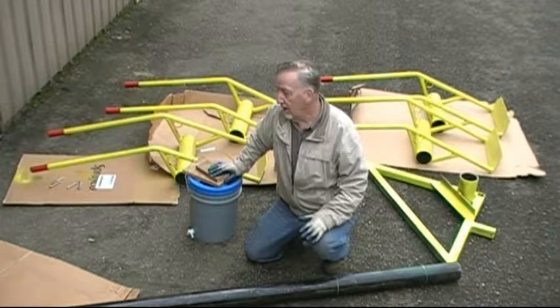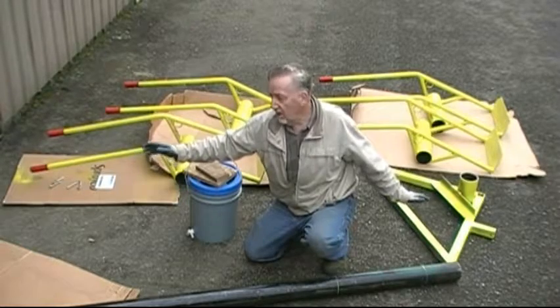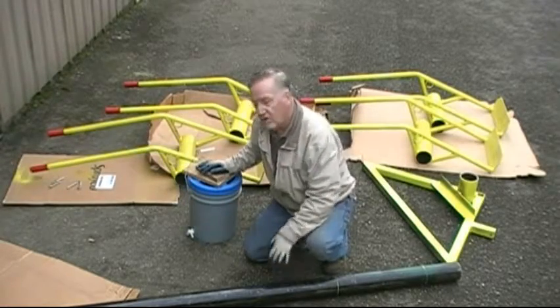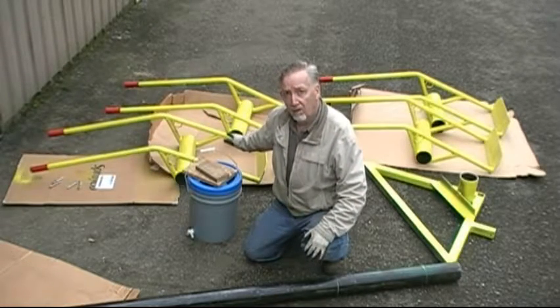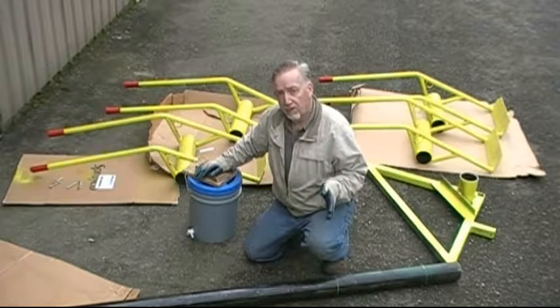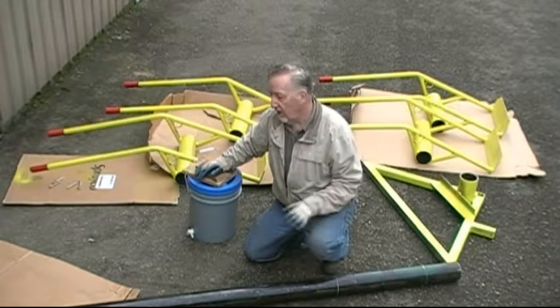So to begin with the assembly, we have two pivot base pieces at opposite ends that are triangular. We have a four-inch diameter axle. We have a number of cradles — four cradles — that are used to buckle the 55-gallon drum into place and then tip them safely on the axle.